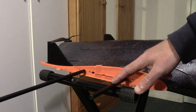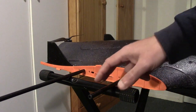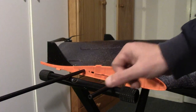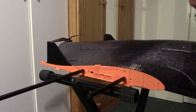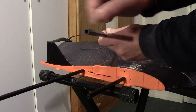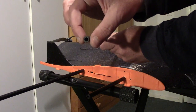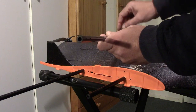Because the 3D printed mounts for the quad arms will use up 65mm of carbon fibre tube on each side, I'll cut new lengths of tubing to make sure that the amount that penetrates into the wing is the same as the original. When selecting the new tubing, I took the opportunity to upgrade to a 2mm wall thickness. These lengths are 10mm outside diameter, 2mm wall thickness, and I bought them as 1 metre lengths.